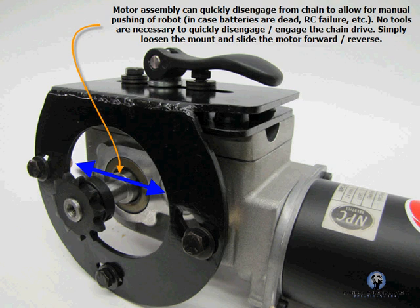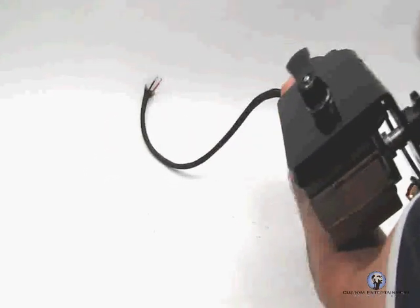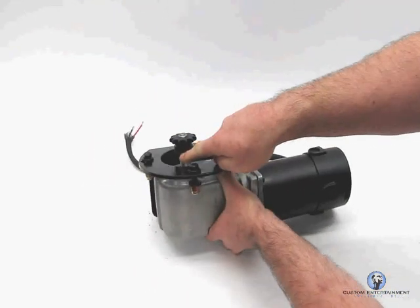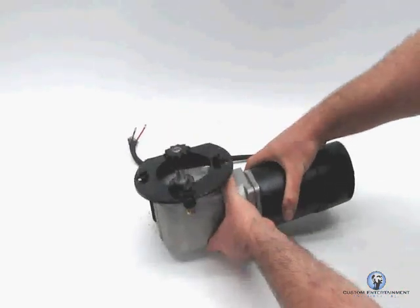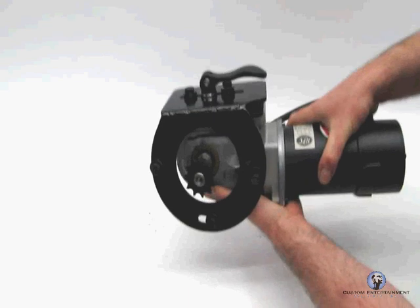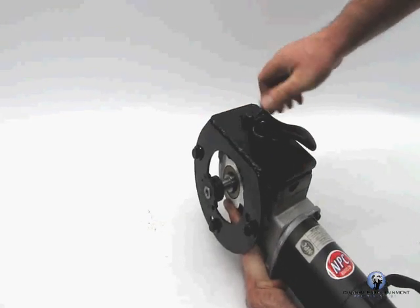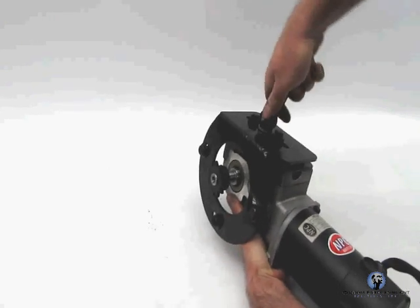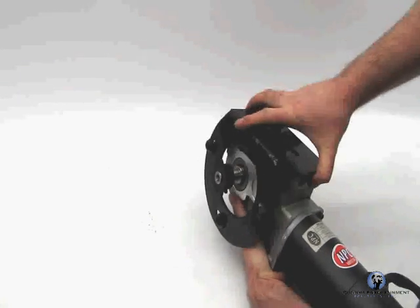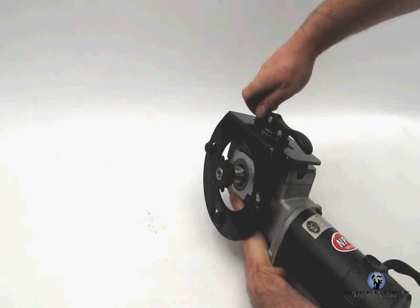Now there's a lot of play inside the system. When you install this on to the AWSM robot it's important to be able to engage and disengage that chain drive to the treads because it's a very positive system — there is no clutch. Those gear motors do not rotate unless they're powered, which could be an issue unless you have the batteries charged all the time. So by undoing that cam lock handle and the two safety bolts — those are grade 5, 3/8-16 bolts — you can loosen that and slide that assembly backwards or forwards. That will either add tension to the chain or disengage the chain system entirely, allowing you to manually push the robot around if necessary.